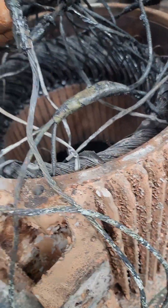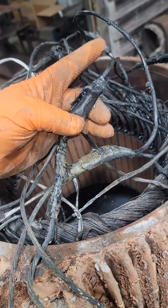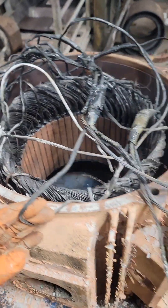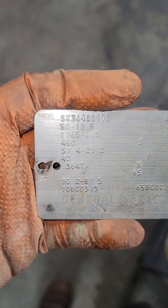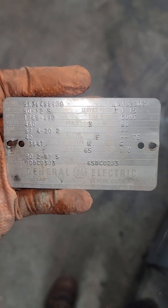This is a four pole and an eight pole variable torque electric motor. We have to pull this connection back and make sure we put it back the way it was, because two speed motors are not just variable torque — they could be constant torque or constant horsepower. The data plate shows straight 460 volts, so we're not changing the voltage to change the speed; we're simply changing the connection.